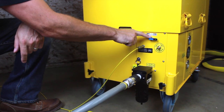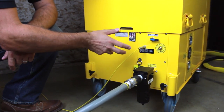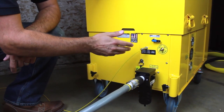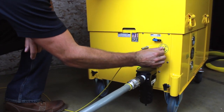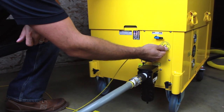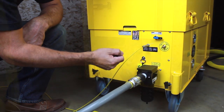With the control in the auto-off position, the vacuum will turn on when a pneumatic tool is activated and will turn off after a brief delay when the tool is stopped. To change the shutoff delay, adjust the dial below the control valve. If the delay needs to be increased, turn the dial clockwise. If the delay needs to be decreased, turn it counterclockwise until you get the results you desire. To bypass the delay feature, you can also turn the control to the on position and start the vacuum.